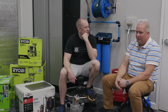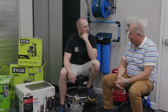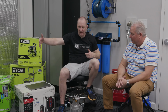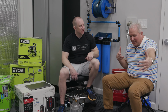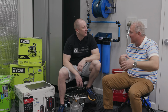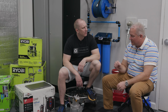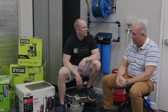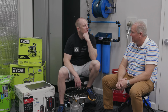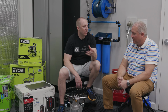So you'll see on the big 4,000 PSI, 4 gallon a minute commercial grade units, you have a wand this long on it. And that's just a safety. But it's still producing the same pressure. Is it so that you can't accidentally hit yourself in the leg or something? It's, I guess, less likely, yeah. Because the pressure's the same whether it's here or there, right? They're very similar. Yeah, it's just less likely that you're going to accidentally stick your hand in front of it. But again, when you get up into these higher pressure machines, especially if you're using the finer tips like a 15, you have to be careful. You can really do some damage. Yeah, they're tools.